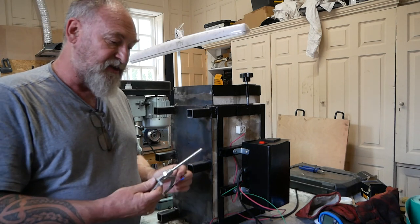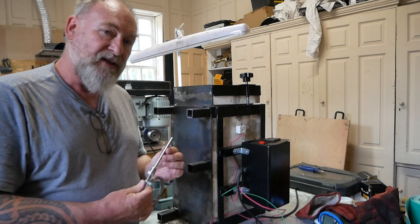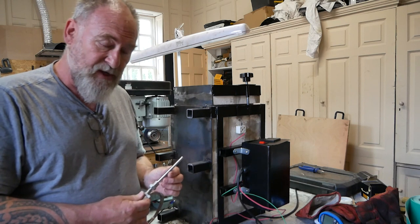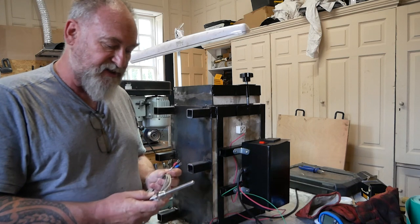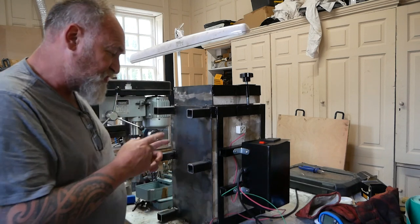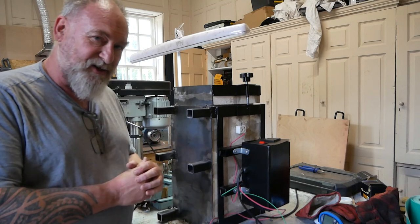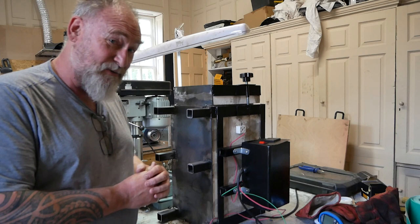That is so that the sensor, the probe, is as close to the steel that you're trying to heat, so you get as true a reading as possible. This is also hopefully a slightly better thermocouple. I'm going to give it a try, but guess who put a steel bottom on the oven? So I'm going to drill through this, trying to get the thermocouple in, and let's see how we get on. I really want this to work.